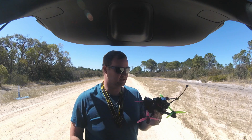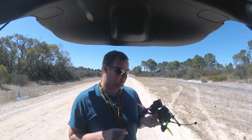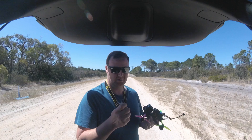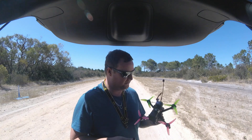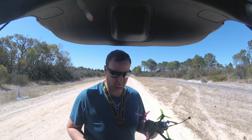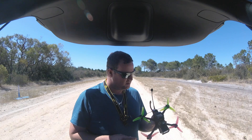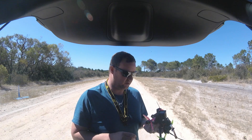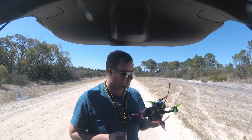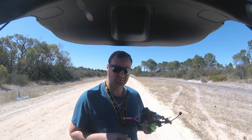Quad's back in one piece. I've now put on the iFlight Albatross — I remembered the name — it's the iFlight Albatross, a 3dB gain antenna. We'll see how far we go. With the TBS Triumph Pro at 500 milliwatts with stock patches, we got 1.7 k's — that's pretty good for a 500 milliwatt system. With analog I've only done about a kilometer on 500 milliwatt. This might actually be good for long-range setups with clear open space. Fresh battery this time, so we shouldn't have any of the dropouts like before. Let's check out this next test.